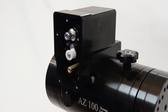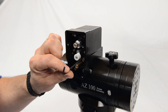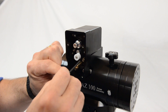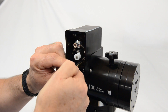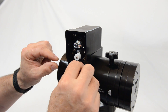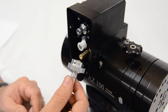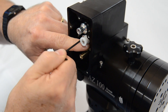These four clearance holes correspond to the four tapped holes in the end of the worm block. It's simply a case of using the M4 by 12 cap head bolt with a washer and fitting all four into the worm block to secure the motor. Finish off the final two, centralise it and nip it up. The recommended tightening torque for these bolts is up to two newton metres — if you haven't got a torque wrench, that's the equivalent of tightening the bolt with the short end of the Allen key about as much as you can and then just a fraction more. Now fit the 36-tooth pulley onto the worm shaft — move the jockey wheel out of the way to give a little bit of extra access.